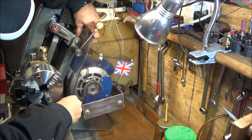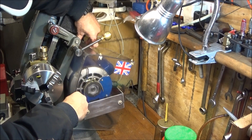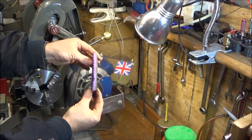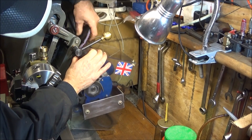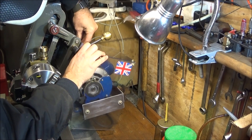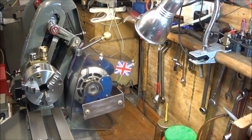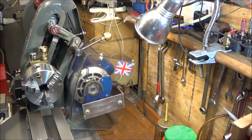That piece goes in between the back of the lathe and the motor just slides in, leaving an overhang which clears the motor well. I then used a piece of foam cut out of an older exercise mat, and that pushes down the back in between the polycarbonate and the back of the lathe, which holds it nicely in position and also stops any vibration on the back of the lathe. You can see it clears nicely when the handle is in its off position.